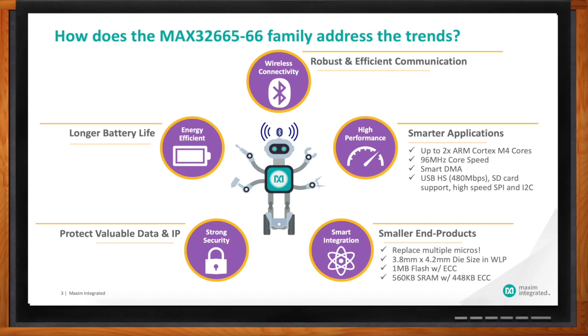To address the security concerns of all these new bad actors, we've also integrated very high-performance security IP in these devices. Maxim has a long history in providing secure solutions to the financial payment industry, where companies like Visa really care strongly about how secure the data is. We take some of that IP and put it into this family of products for the IoT — things like AES encryption, SHA hashing, DES and triple-DES encryption, elliptic curve cryptography, RSA — all that alphabet soup of stuff that's really the building blocks for the secure internet.